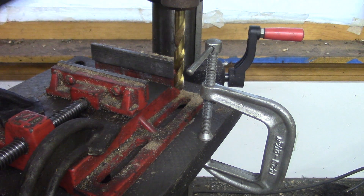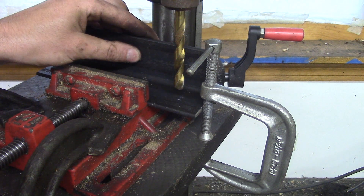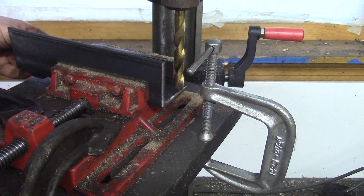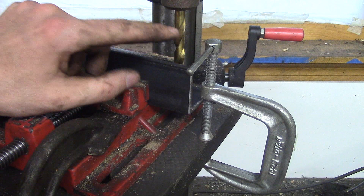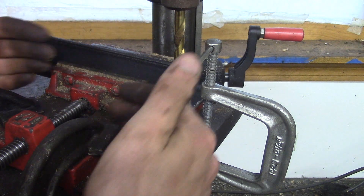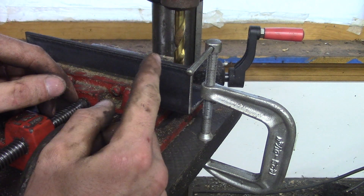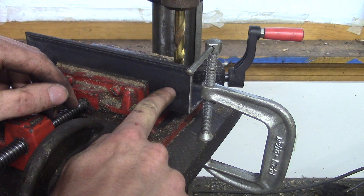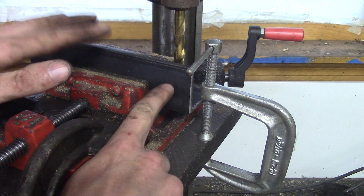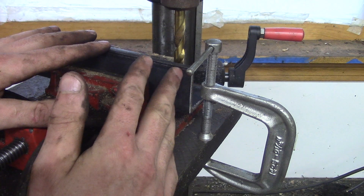In this case I can only drill two of these holes — this one and the one in the opposite corner. But if I wanted to drill the other hole, I can't just flip it and put it in this way, because this drill bit is drilling a hole that is an inch and a quarter away from the back jaw. So I'll have to drill two holes on each piece, then take my setup piece, flip it around, line the drill bit up again with the center punch mark — move my vise forward or back — align everything up again and drill the final two holes. I could save myself that trouble by drilling a hole directly in the middle of this two-inch piece, but I don't want the hole there, so I'm putting it a little further out to the edge. As a result, I need to change my setup halfway through.